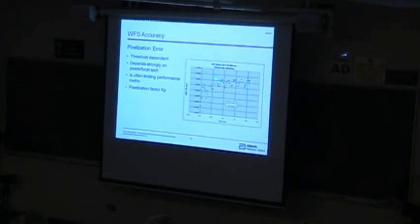And the period of this is exactly as the spot moves 1 pixel on the CCD array. So that's a systematic error that's a fundamental property of that whole centroiding operation. It isn't as apparent in the Y, because in the Y, we're not really systematically moving across those. It's just some random variations that we're getting.